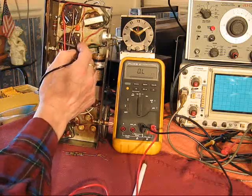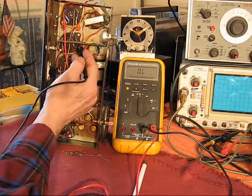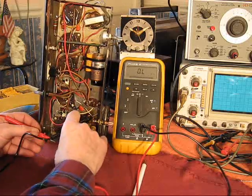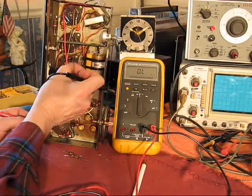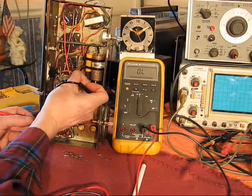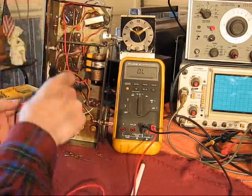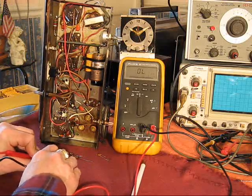There was this guy here, this 150 ohm. Pretty sure he's in the cathode circuit of the 50C5 here, the audio output tube. What was in there? Look at this teeny weeny little piece of squirrely crap that they put in there. And this is enough current flowing through it to get hot. And it just zorched it. 150 ohm resistor, right? And that is 20% tolerance.